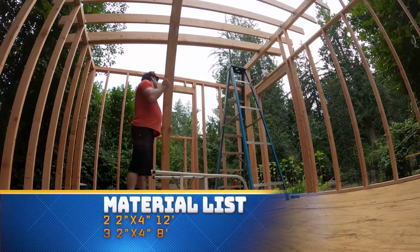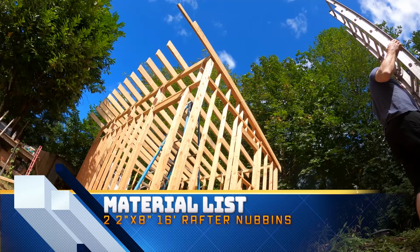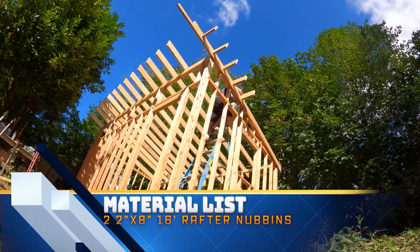Once I had the majority of rafters in place, I had to finish the framing of the outer walls before I could install the 2 rafters that sit on the edge. To help attach the 2x8 rafter nubbins, I fastened a scrap 2x4 to act as a temp ledger. This helped keep everything in line as I screwed them in.